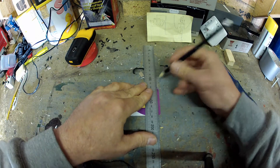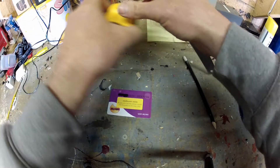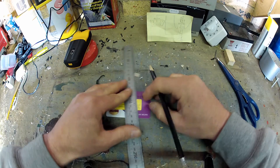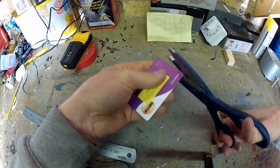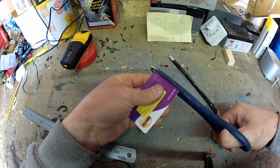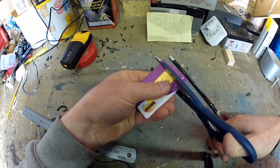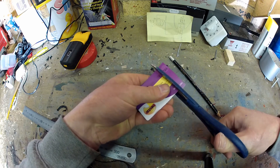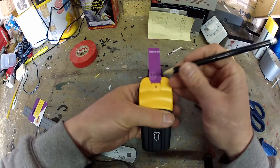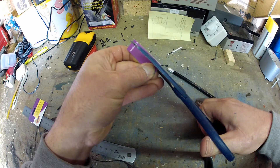The cable I'm actually going to make is going to be from the Garmin to a USB, because the one you buy is from the Garmin to a serial port, and a lot of computers don't have serial ports anymore. I've got an interface USB-to-serial cable, and all I'm going to do is make a plug with this card — any plastic card, they're all about the same thickness — and make that connect to a female serial port.